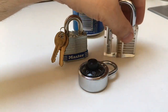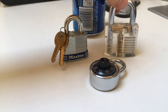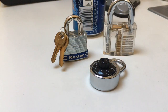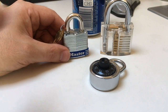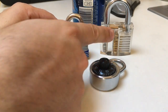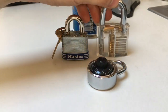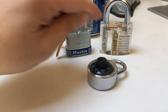I've got a couple of padlocks here which I know can be shimmed — two different types really. This plastic practice padlock and this Master Lock 3 have a locking dog, which you can see here in this practice lock, which attaches to the shackle at both ends. So these can be shimmed but you need a padlock shim on both sides.